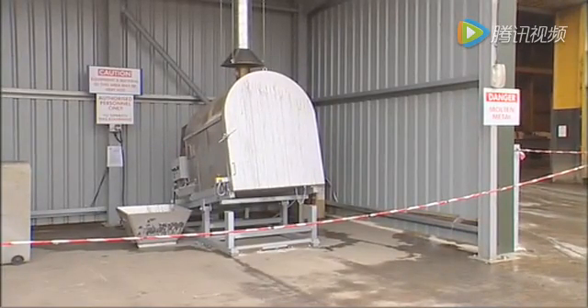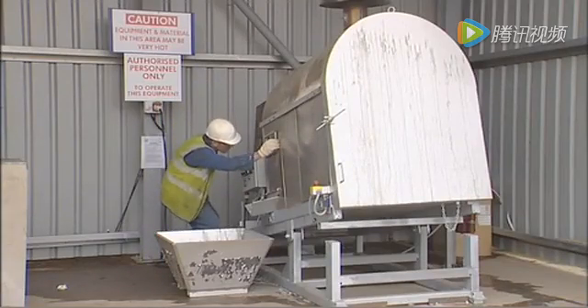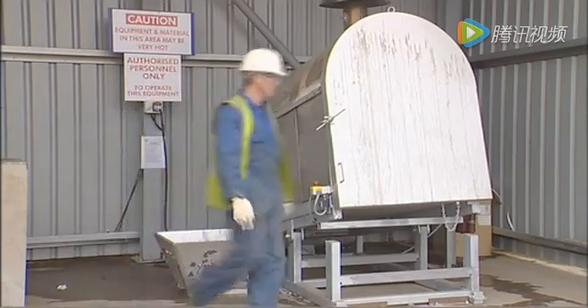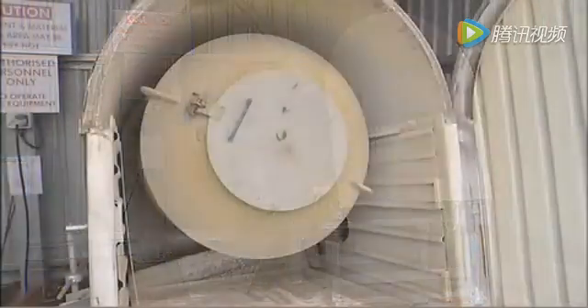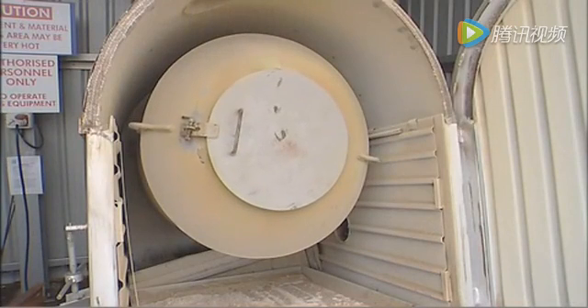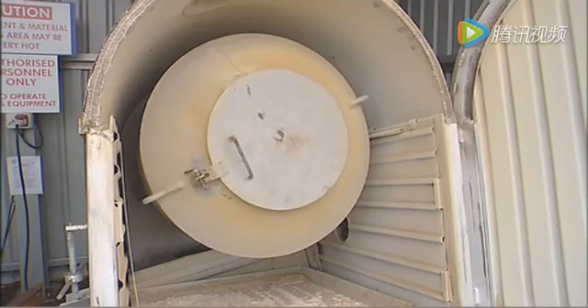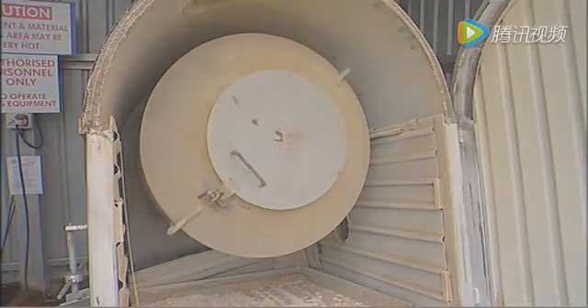Losses and skimmings of your galvanizing bath. It's easy to control and loading and unloading is straightforward. As we run through the process, it's important to remember that the drum must be allowed to rotate for the full three hours, or you'll have a lumpy and useless residue in the drum instead of the light and free-flowing powder that should be there at the end.